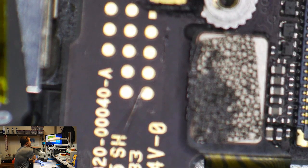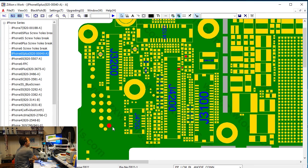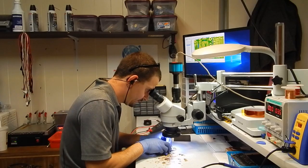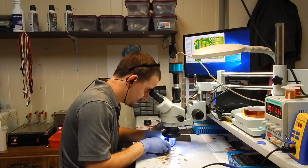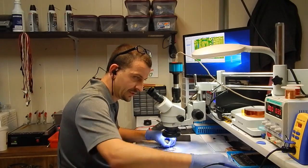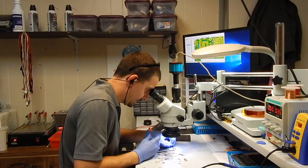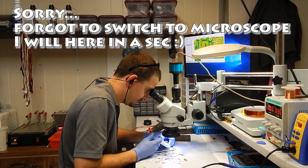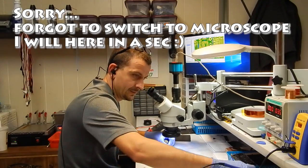So anyways, we got test point 22 here. This one is going to have VCC main present. Well, in the long haul, VCC main, it's our backlight anode on that side. This is our other backlight anode that is smoked. And rather than spend a ton of time troubleshooting this and wasting a bunch of time and causing me more headaches and other things that don't work due to previous repairs, I'm going to cheat a little bit.